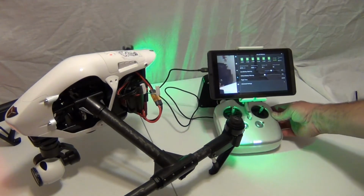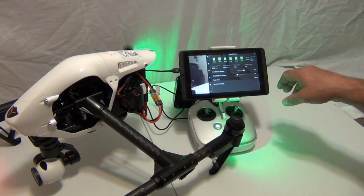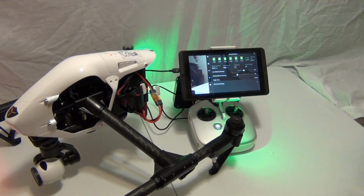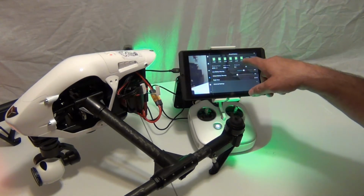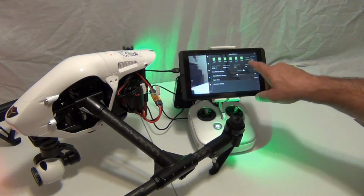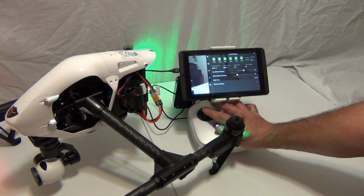Take off. Like I said, we go into the battery settings, and it's showing a flight time. The telemetry's working. The temperature sensor is just dangling over the battery, and all the cells are showing right now 4.15, 4.16, 4.15, 4.12, 4.14, 4.17, and 24.89 volts. But if right now the drone is running, even though there's no load, the voltage is 24.76. Well, let me shut it off.